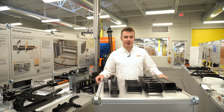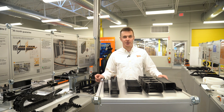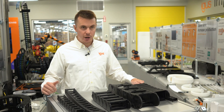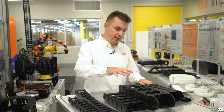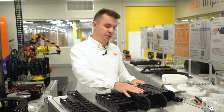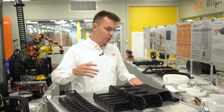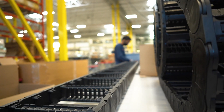Hi, I'm Dan Thompson, Senior Product Manager for IGUS Energy Chains, and we're here today to address some frequently asked questions relating to part number identification of various IGUS products. Customers replacing worn-out energy chains will ask us how to take the part numbers off of the energy chain and turn it into a top-level part number that can be used for ordering. We're going to go over that for our E2, E4, and E6 style energy chains.